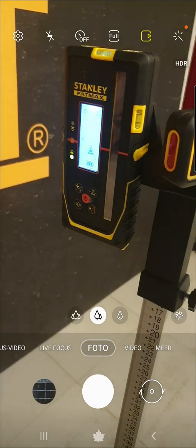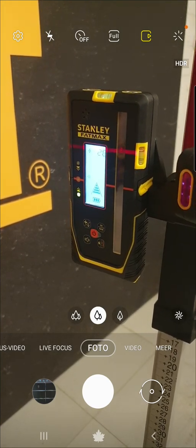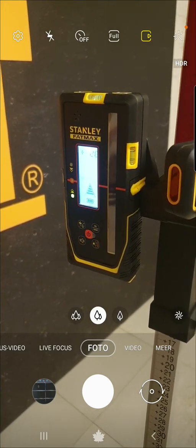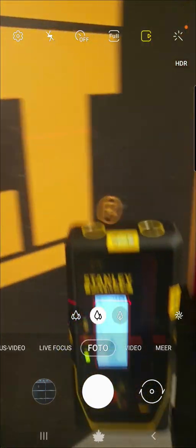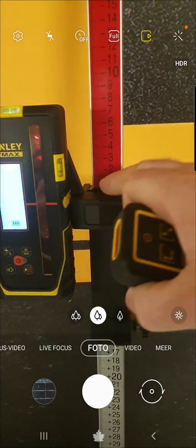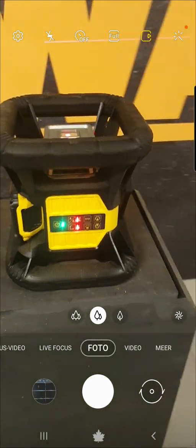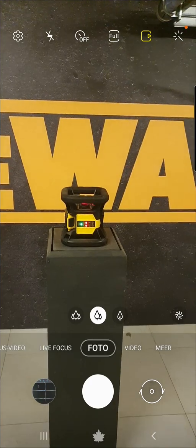My camera turned off, sorry. So: 25, 26, 27, 28, 29 millimeters... 30. Now you see it's at three centimeters from the zero position. Now I have exactly set three percent slope with the detector. Normally you should take the detector and move it to three centimeters and after that put it back, but with a millimeter detector it's much easier and works faster.